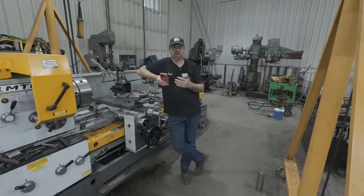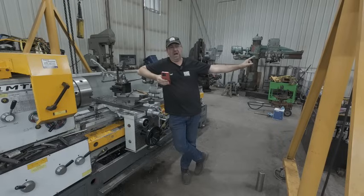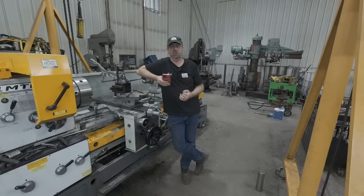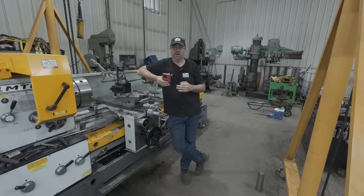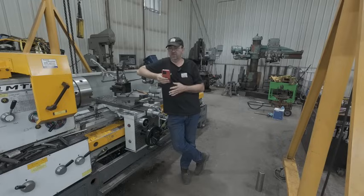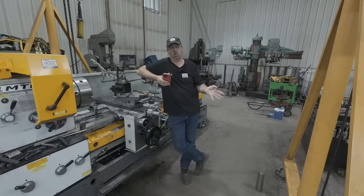Somebody else commented about touching it up with a flap wheel — absolutely not. I do not grind on the machines. The weld shop curtain is over there and the grinders do not come beyond that curtain ever. I want none of that grinder dust in the shop. I've worked in shops that had grinding in with the machining and the machines deteriorate so fast — that dust gets into everything and destroys the machines. I have a tool post grinder but I will not use it unless conditions absolutely require it. Otherwise I send stuff out to a cylindrical grinder. I got rid of my surface grinder because I can send that out for less than what it would cost me in time, and I'm not using one enough to justify it.